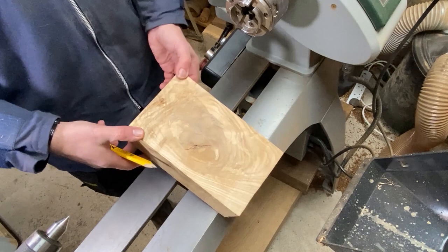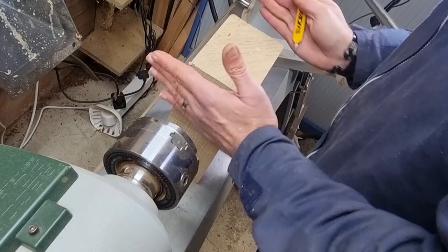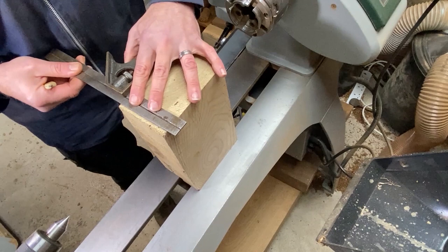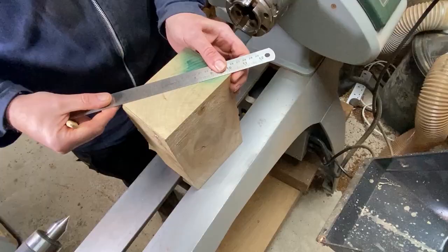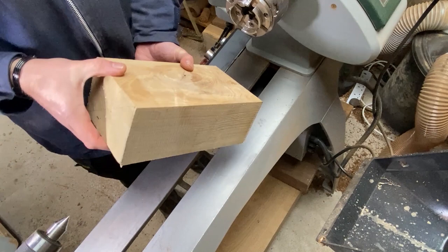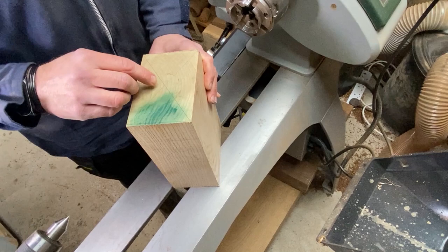The first step when doing this is you're going to find a centre to work around. The top and bottom are all plain flat and are parallel to each other but the sides are a little bit wonky. So I'm just going to get a right angle between the two sides so we can hopefully find the centres. Right, we've found the centres. Now we're going to mount this with a worm screw, and because the worm screw makes this sit flat against the chuck it's always best to try and find the flattest end to set it into.